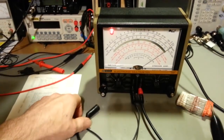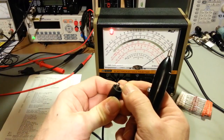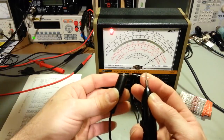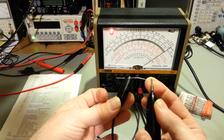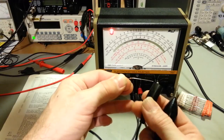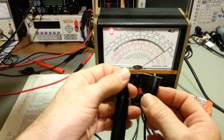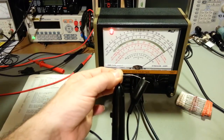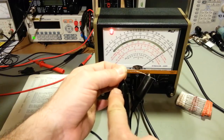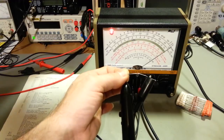It's good right there. And now, like I say, we have it in the low power range. We'll connect the ground clip to the anode, probe tip to the cathode, and you can see nothing. And then I'm just going to leave the diode in the same orientation all the time. We'll switch around here. Now, this would normally turn a diode on, taking a normal ohm meter and applying your probe tip to the anode and your ground clip to the cathode. But you can see, nothing happened.